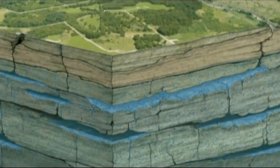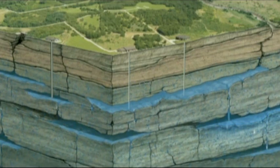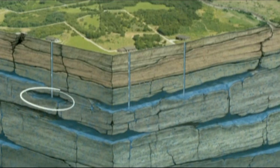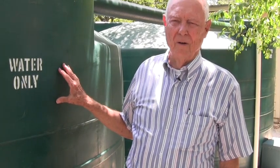The Trinity aquifer that we're in up here is a weak aquifer. We're in a priority groundwater management area, which means that within 25 years from 1990 you're likely to experience water shortages, which we're doing. As the population keeps growing, we don't have the water to support it. With a rainwater system, you become the manager. You design a system for drought-of-record conditions, then you manage it, and you will always have water. The wells will go dry, but you'll be set up fine.